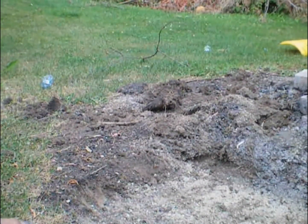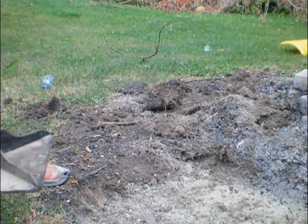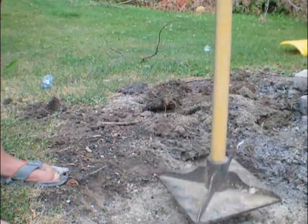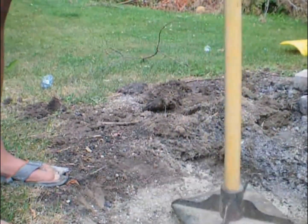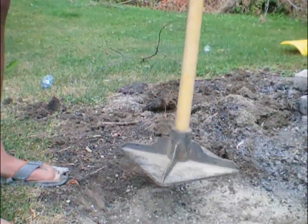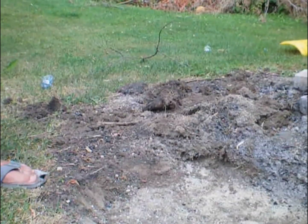As you can see, I've dug a pit — it's about two by two, that should be good. Now I'm going to grab a tamp, the tamping tool, and just tamp it flat and compact. Now is the time to tweak out your base. Like I said, this is just a small forge. Now that we have our base tamped, we want to select bricks for our forge.